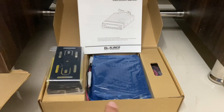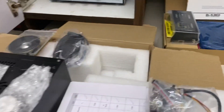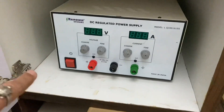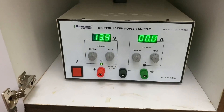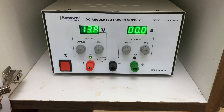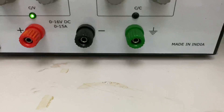Before you can possess these radios, you should have a ham license, which in India can start from restricted grade to general grade. These are very sophisticated instruments and you need to take care of them. The power supply is set to 13.8 volts and there is a coarse current control — I can limit the current to a particular value so that if there is a short circuit, it trips off. The red lug is positive, black is negative, and green is for earthing.